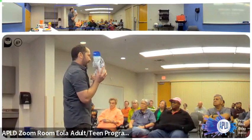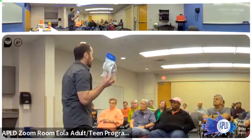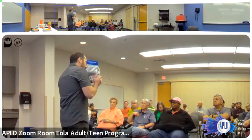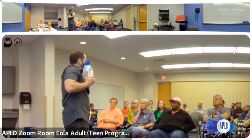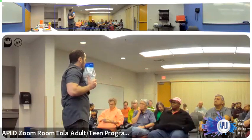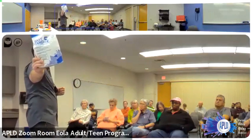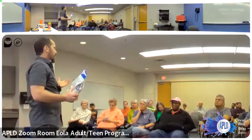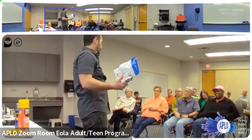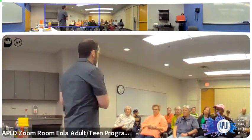This stuff, on the other hand, you are going to have to mix it yourself. It just takes water. Usually you have water available if you're doing anything at a home, okay? So the other thing is, see this one right here, that number five? That's what you're looking for, is one with the number, okay? They sell it in both easy sand and not easy sand, okay? The not easy sand is harder to sand, usually costs a little bit less.